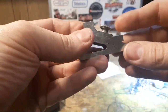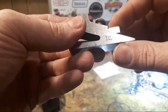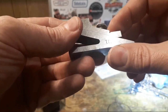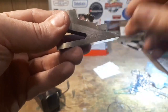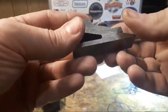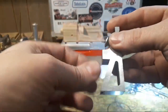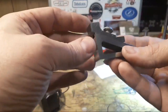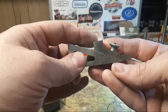And it's used for a million things. It's used for setting a tool. It's used for measuring the amount of cut you need to take off something. And it's useful for measuring the distance that you've got sticking up out of the vise, or clearance that you've got. It can be used this way too, which this one gives you about 3 inches that way, and down to about 1/4 of an inch that way off the bed.